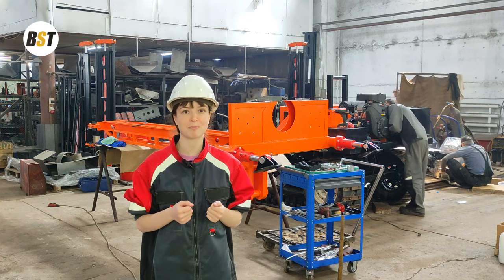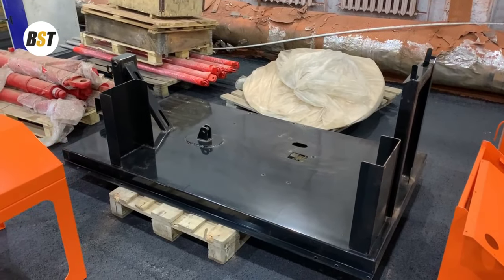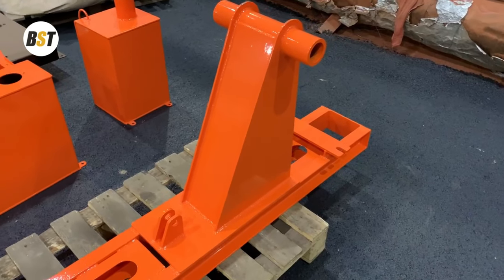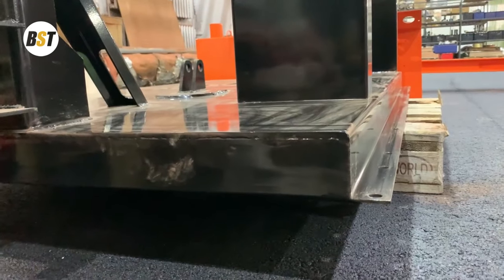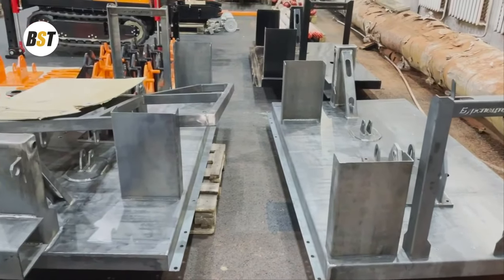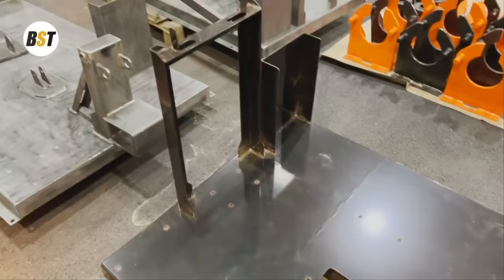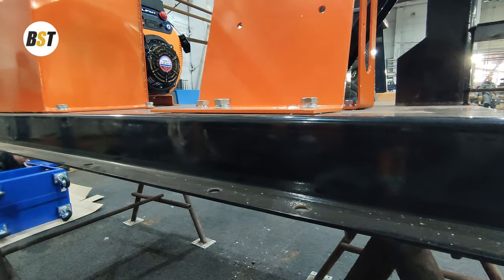The frame is the main fundamental component which holds together the whole construction — the base and the mast. The mast can be designed to work with 1, 1.5, 2, 3, or 4.7 meter tools depending on the size of the drilling rig. The metal the frame is made of is produced and supplied by the metallurgical plants of our city, Chelyabinsk — therefore high quality and robustness of not only the frame but all metal components are time tested. For small size drilling rigs, solid drawn metal frame is used; it provides durability and makes the drilling rig heavy and therefore more stable.